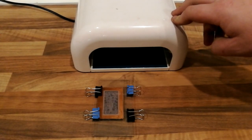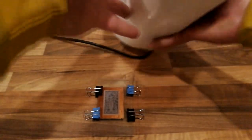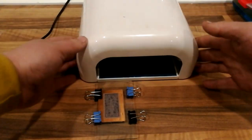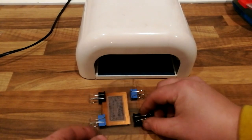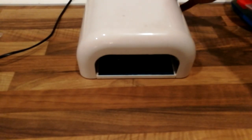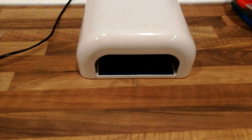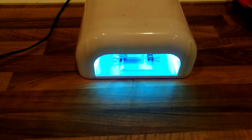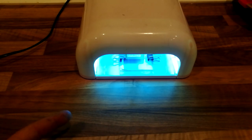This is the UV oven I was talking about. It has a few of those basic energy saving lights in there - I guess these are some special UV ones since the light color is kind of different. Anyway, for a board like this with a lot of light, I will keep it in here and turn it on so you can see. It's a nice little bluish color in there. I will develop this completely and then come back when it's ready.